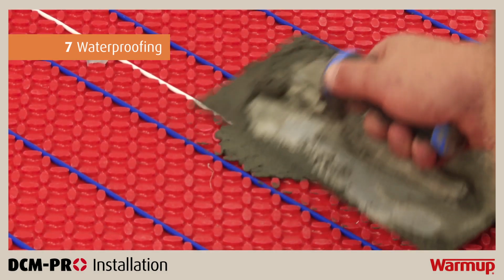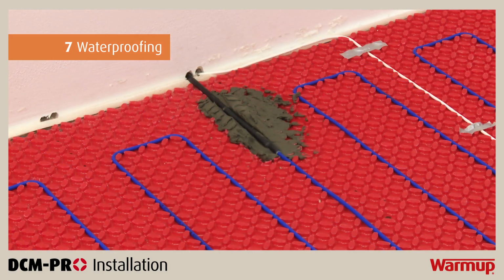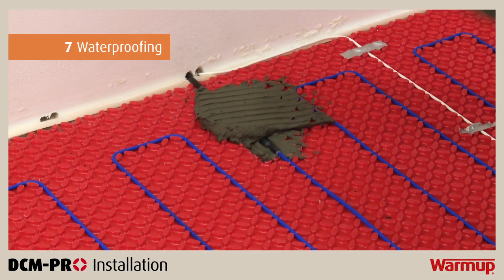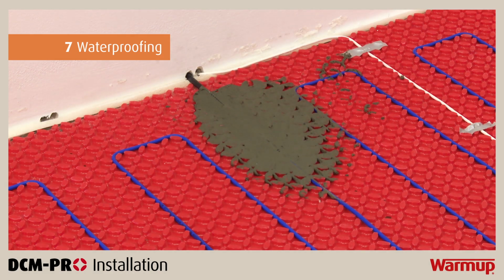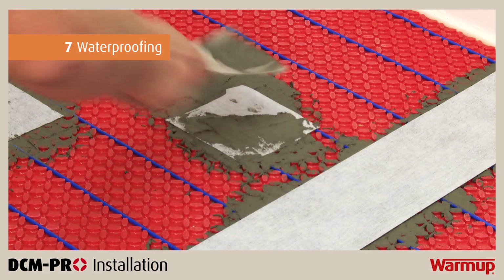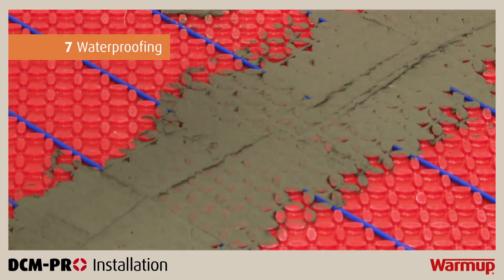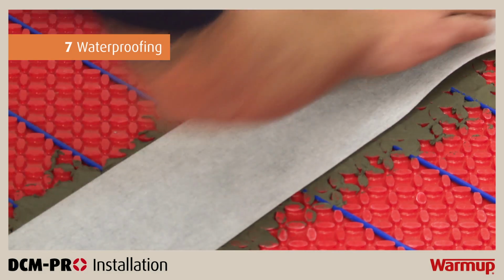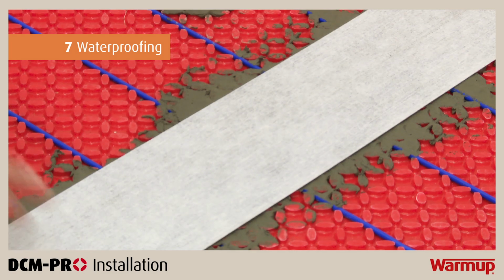Apply a layer of waterproof adhesive 100 mm either side of the joint. Be sure to check that the cavities are fully filled. Ensure there is a full bed of adhesive over the cold tail and termination joints with no air pockets. Cut a suitable length of waterproofing tape and press it into the adhesive using a trowel. Again, make sure that all air gaps and creases are removed. Where joints are required, overlap the tape by 100 mm, bonding the two lengths together with a layer of adhesive.